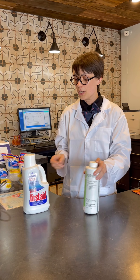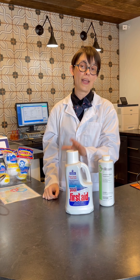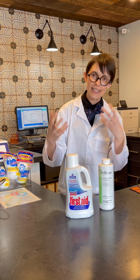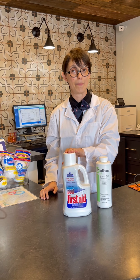And from there, you can clear up your pool super easy using this handy dandy chemical called Pool First Aid. This is a chemical that, as long as you don't add any shock for 48 hours, goes through and eats up all that dead stuff in the water and harmlessly gasses it off. You can swim while this is in the water, you can enjoy it, and within 48 hours you should have your pool back to where it needs to be.